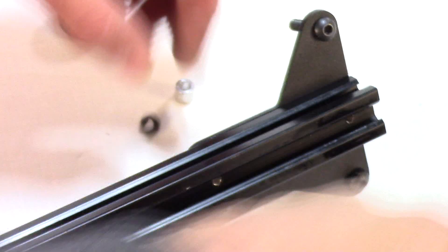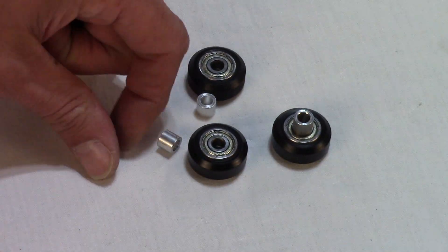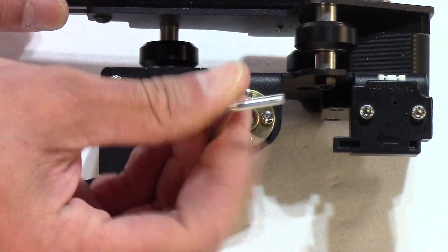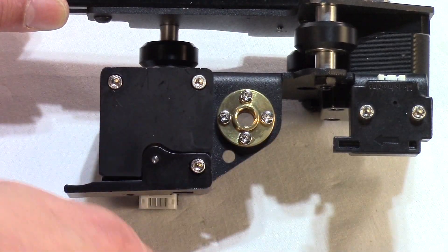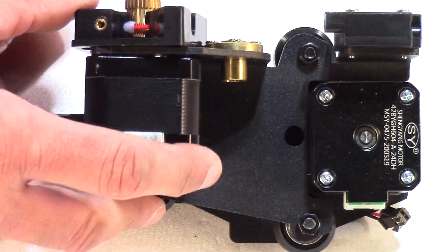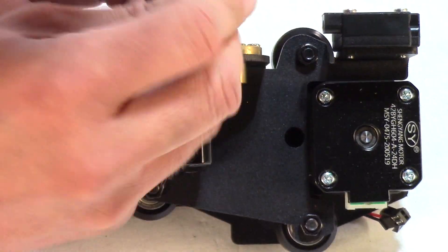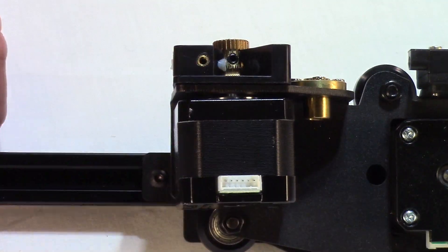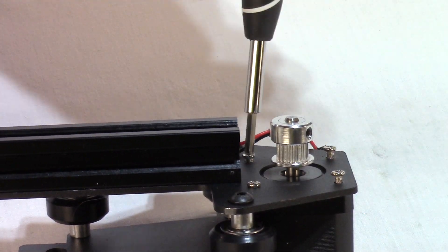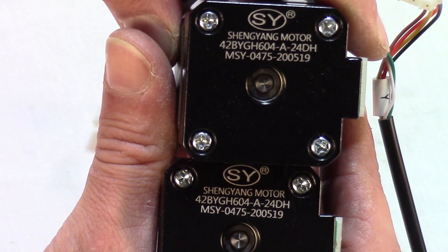Save the screws and nuts — they will be used to connect the bottle cutter to the base frame. If using the single motor setup, remove the extruder gear motor: unscrew the three hex screws holding down the cover using size 2.5 hex tool, then remove the fourth screw holding the motor to the frame, and unscrew the grub screw in the extruder gear using size 1 hex tool. If using the dual motor setup, remove the X motor on the left side of the gantry arm, loosening the four screws using a Phillips screwdriver.